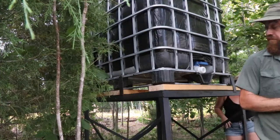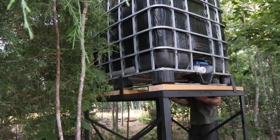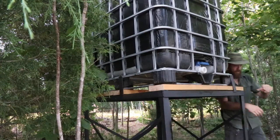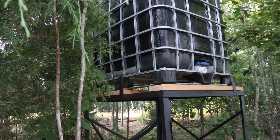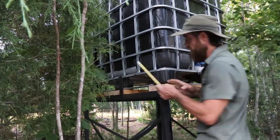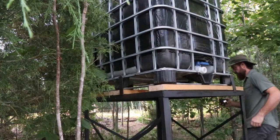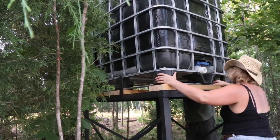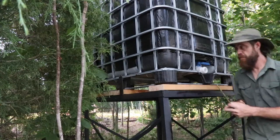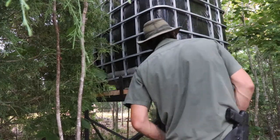That's great. All right. Is this thing centered on the structure? Looks pretty good. We could probably go this way a bit. Just a hair? Yeah. I could put a tape measure to it, to be sure. It's actually probably worth it. It's gonna be a lot of weight. I got 2 3/4. I got 1 3/4, so we need to go that way a little bit more. Like a half inch? Yeah, roughly. 3 3/4. That's good. 2 3/8. About 2 3/8. That's pretty close. Sweet. Cool.